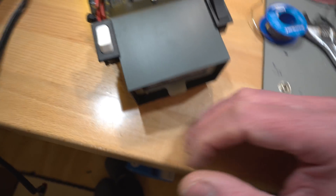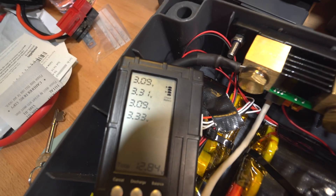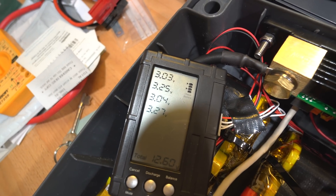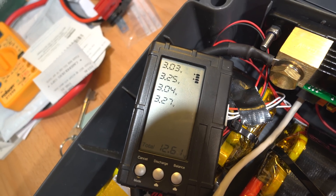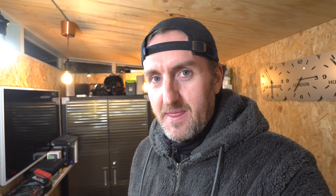There's a lot of heat coming off as you'd expect, and we're now pulling 24.5 amps out. Down to 3.09 volts per cell — still going. Approaching 3.03 volts on one and 3.04 on the other. It's really interesting that those two are lower. I'm holding out hope that those two cells were just part of the pack that wasn't balanced the same as the others, since it came from a big e-bike pack.